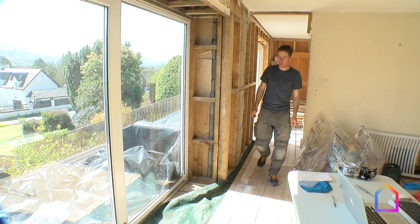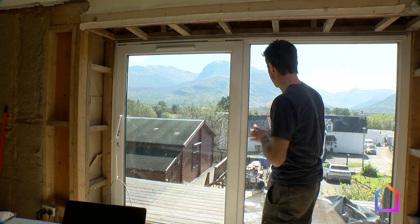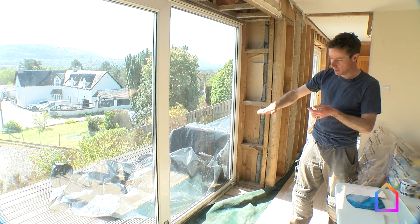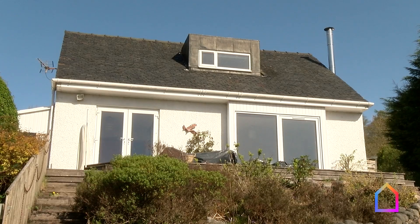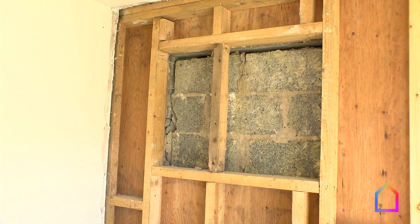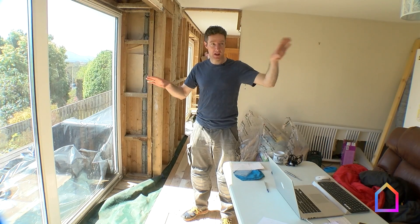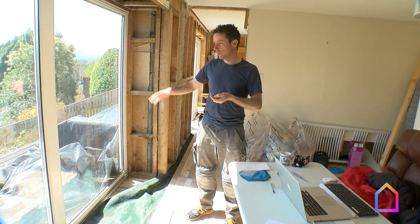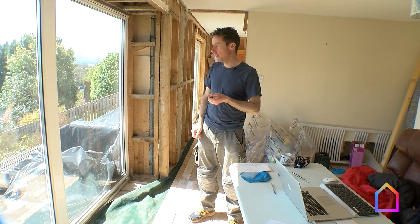This is the living room, and we've got two big changes we're making here. When you're sat on the sofa at the other side of the room, the view of Ben Nevis is split by this mullion, which always seemed a shame. So we're replacing it with a single piece of glass, and making it a bit higher off the ground to reduce solar gains in the summer and the overheating problem, because this room already overheats a bit on sunny days. We're also putting another window in over there — an opening window — so that will even the light out and enable us to cool the room when it gets too hot.